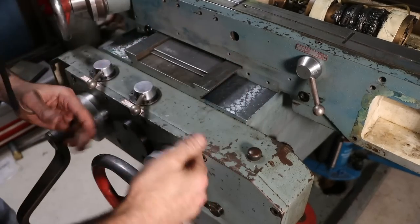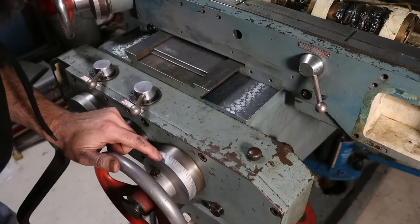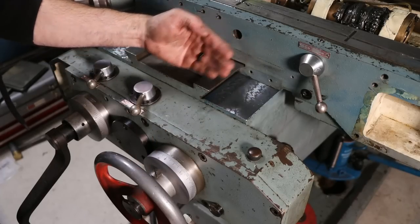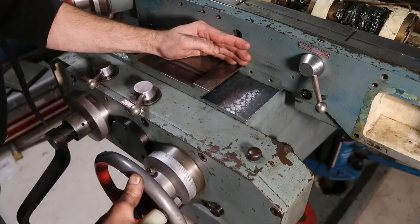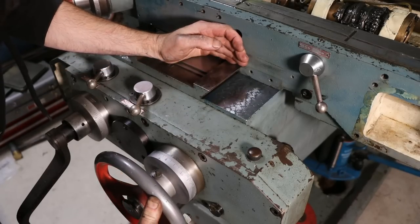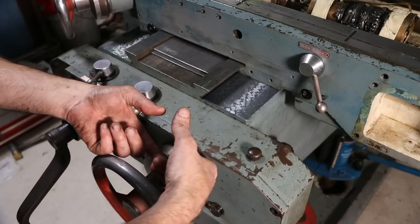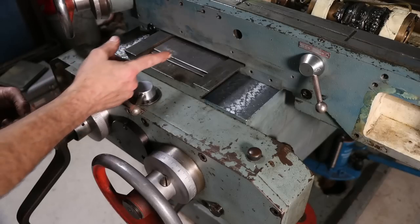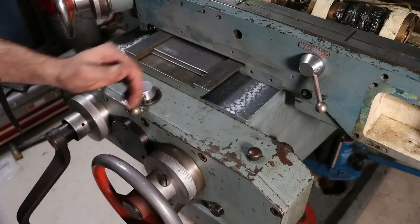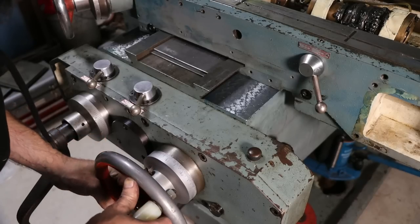I'm going to do a rough backlash check on this lead screw here in the saddle. We've got our dial on here. Let's turn this to zero, get it lined up, and then turn it back the other way and see how much slop there is in the movement before the saddle actually engages. Wow, so less than 15 thousandths — I'm just doing it by hand. We could put an indicator up there, but you'll just have to trust me. That's pretty good. I did no adjustments on the lead screw, plus this runs a gear that hooks into a gear here that powers the lead screw, so we have gear-to-gear tooth contact that can give us backlash, plus the wear in the screw and the nut. Less than 15 thousandths — it's not bad.